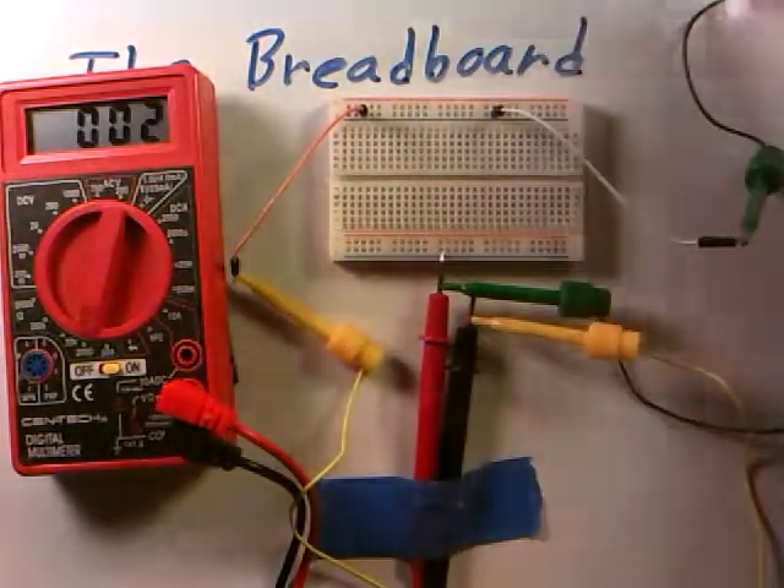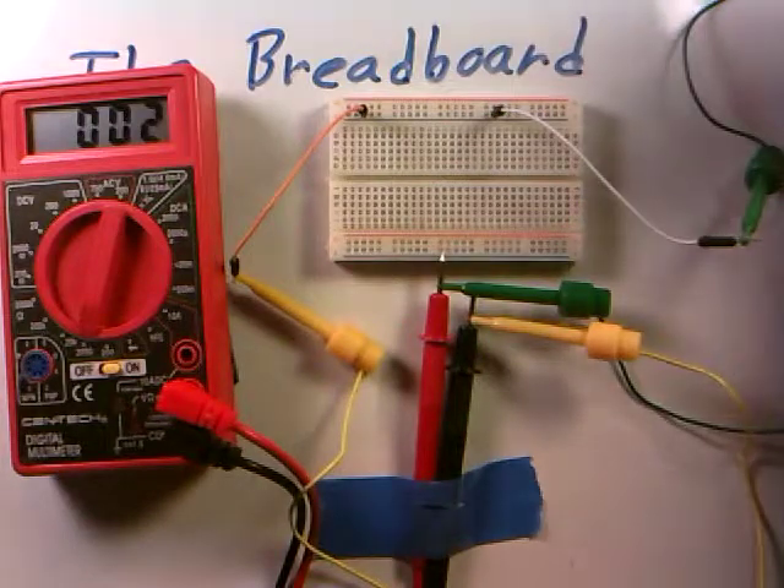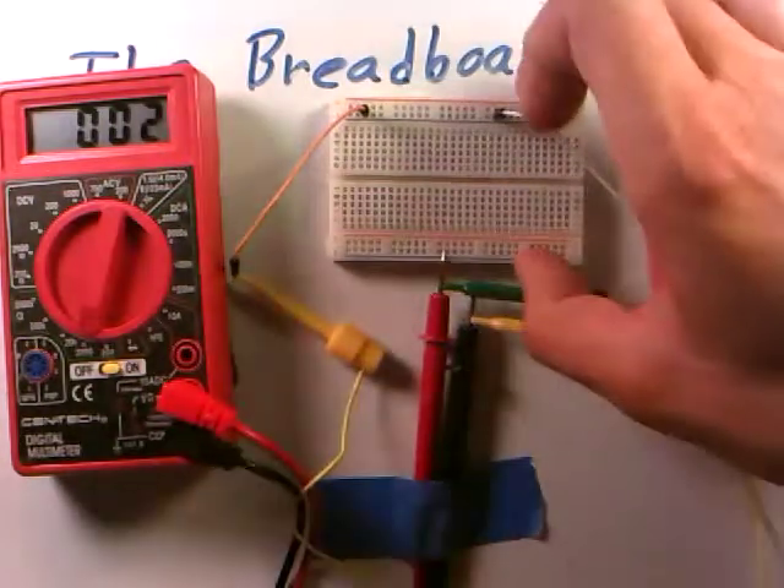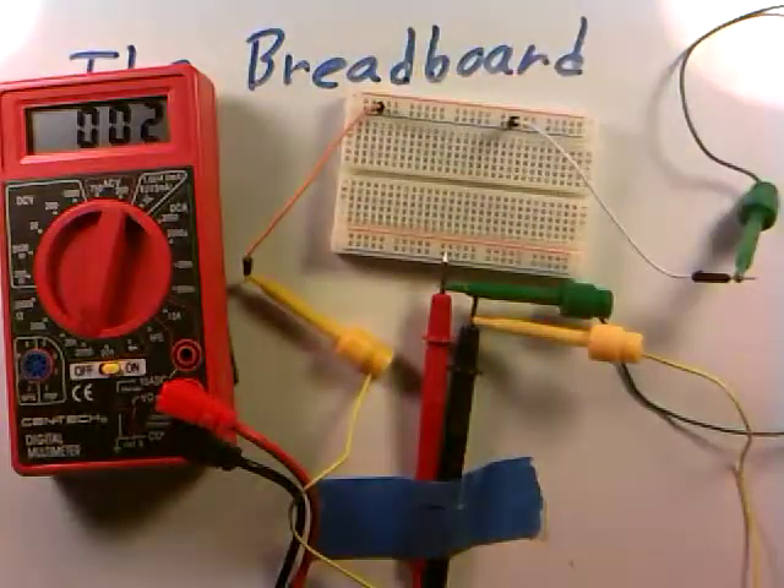So this is just a great way of messing around with the ohmmeter and understanding what information it tells you — if you get zero resistance, there is a direct electrical connection between the two points. The breadboard is a great thing to test those ohmic measurements on.